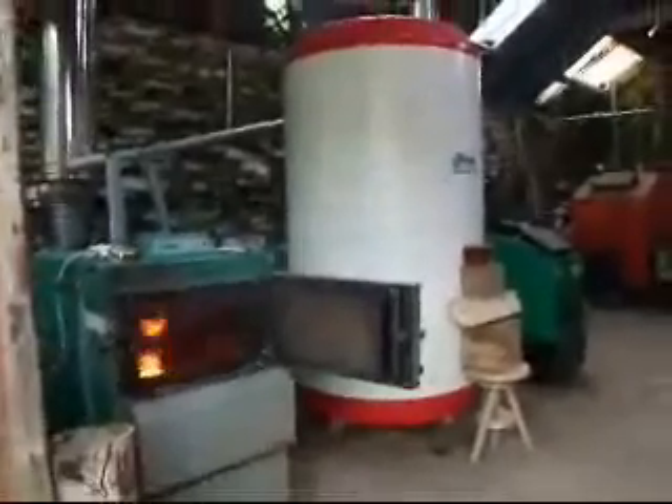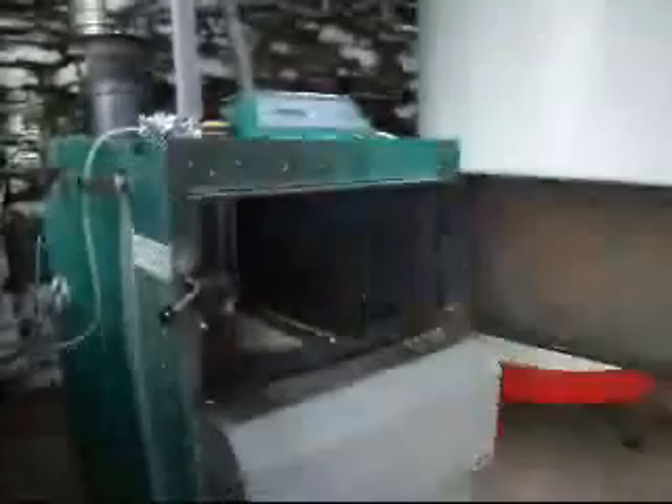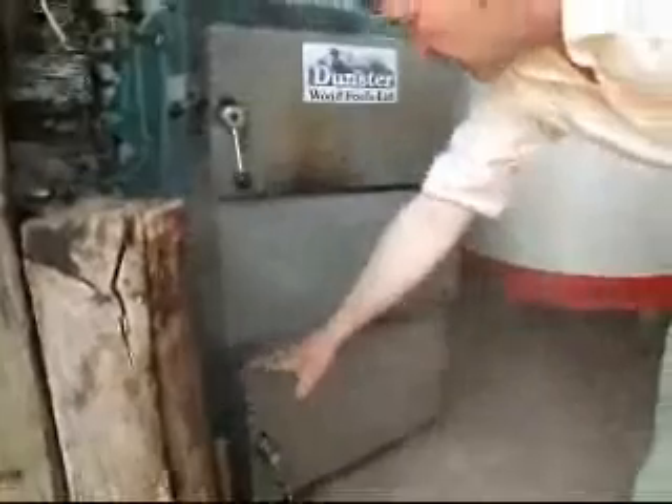It looks after the heating of the accumulator. I'll fill that with wood just before I shut the door on it, and it will put all the heat into that 1,000 litre accumulator. I'm going to put the logs on here, up the side of it. So there we are — I've laid that in. I'll leave that now. I'll leave the top door slightly ajar and open the bottom door to let the draught go through.